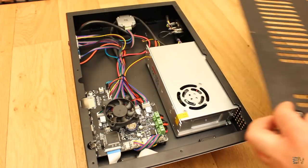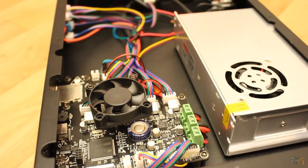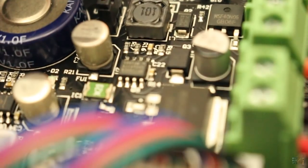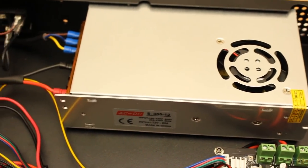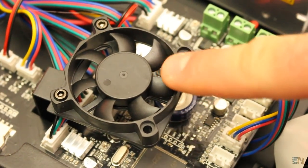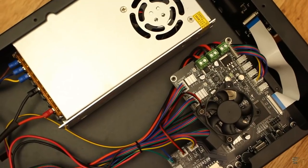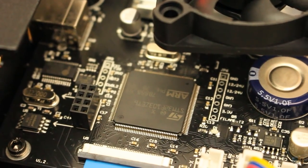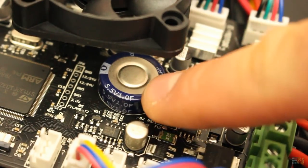Now, inside the main case, the first thing that I've noticed is that there is no external MOSFET, so that might be my first concern. The bed is not that big, but an external MOSFET is always better in order to prevent the main board from burning out. Anyway, the rest looks perfect — the wires are well organized and zip tied in place. The power supply is inside, so that makes this printer quite safe. We also have a direct fan for all the components on the main board, so that should keep them cool. It is quite clear that the board is made for this printer case since I've never seen this one before. It also uses an ARM microcontroller, and the very strange thing is this huge capacitor in the middle, but that must be a good sign.